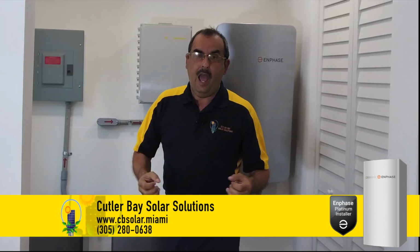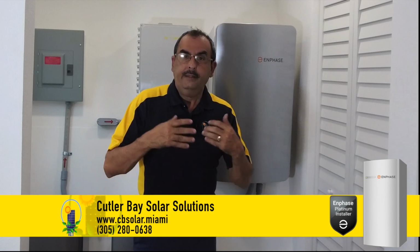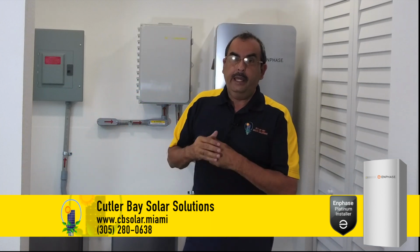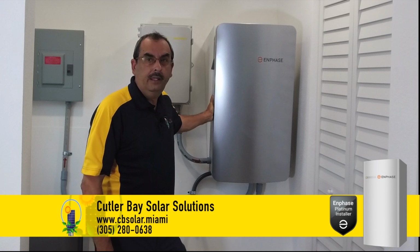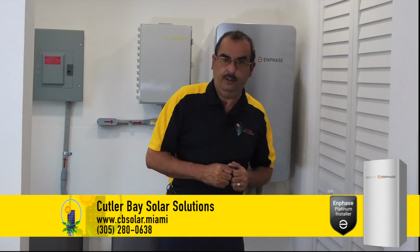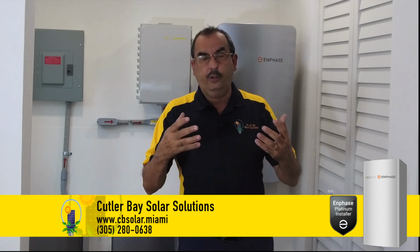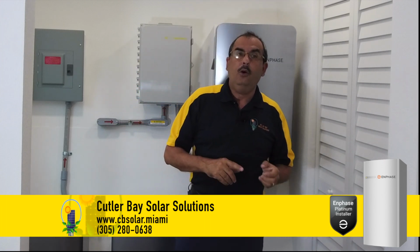So that leads me to the third point and another basic difference between the PowerWall 2 from Tesla and the Enphase Ensemble in charge battery system. The Tesla PowerWall 2 has a 40 amp ability to operate your appliances at home. The Enphase Ensemble in charge has 80 amps. It comes with an automatic transfer switch for 200 amps, meaning that you don't have to predetermine and segregate and put different loads on a panel that you're going to choose to run when you're running under an emergency. And while we will be the first ones to tell you that no battery, including the Enphase Ensemble in charge, is going to give you unlimited power during a power outage, we will tell you that by having a 200 amp transfer switch, you have a much larger variety of choices to make when the time comes.